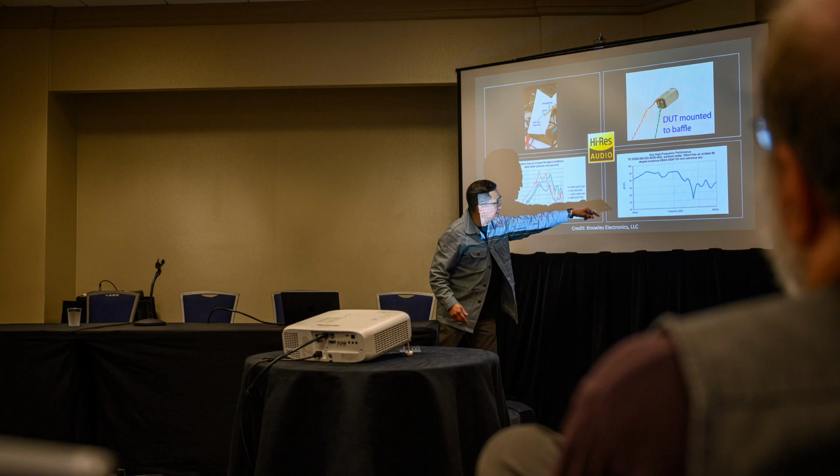But ignoring that new tweeter, right? When this was released, that didn't exist yet, this new Knowles tweeter, which I think is supposed to have even loaded extension to 20K or beyond. But with a normal BA, you're going to see roll off, and it's precipitous, 15, 16, 17K, and it's gone after that when you load it. So again, if you want to know what it's like to a human, simulate what it's like on a human. That's not it, but you show capability to 40K.